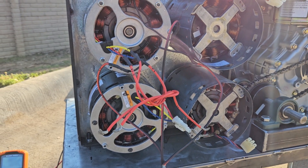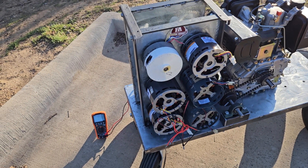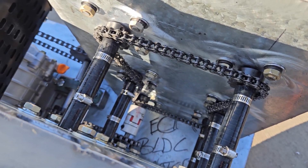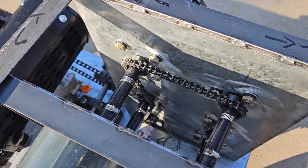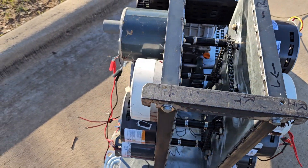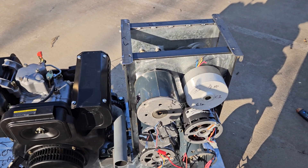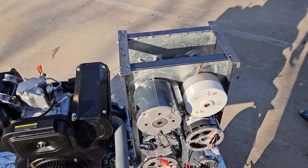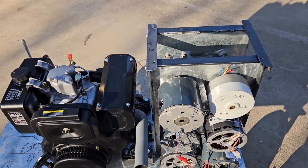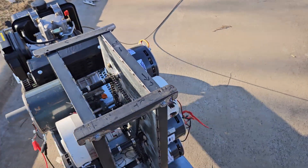I need to cross-check all the voltages. If one of them is really high, one technique is to get a slightly smaller sprocket on this gearbox — Tim called it a clock box so I just call it that too. I can calculate what I need to get the voltage the same; that's one option — just gear it. As long as we come close it's all right; they'll slave down to each other. If you parallel them all up in DC with rectifiers, they're not going to fight against each other — you'll just feed forward and voltage stays at one level.